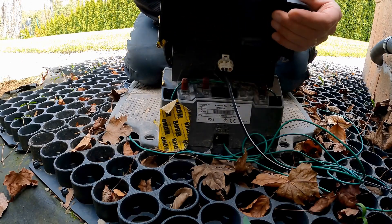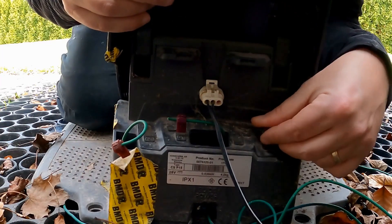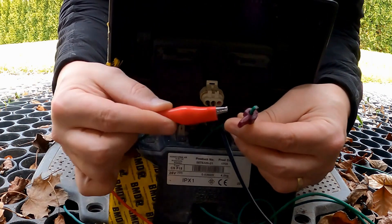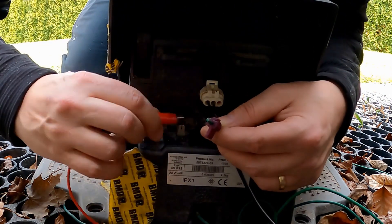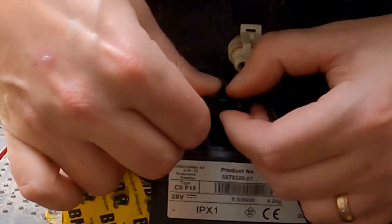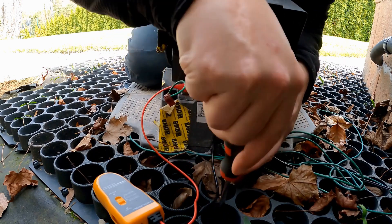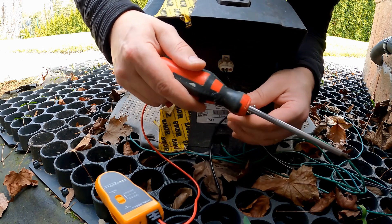I connect the signal generator to the back of my charging station. I remove the side boundary cables — my focus is solely on the control cable. I now need to establish electrical contact with the red cable. I attach the alligator clips at the connection of the charging station; as long as electrical contact is established, it works. The black cable needs to be grounded — a regular old screwdriver inserted into the ground is sufficient. The soil should be rather moist so that the current is conducted better.